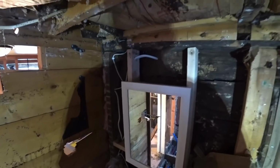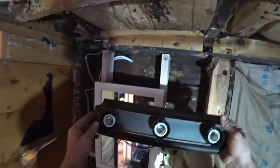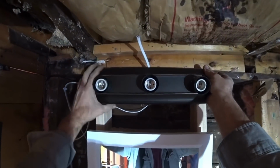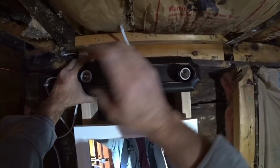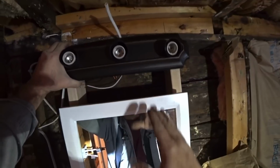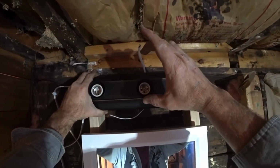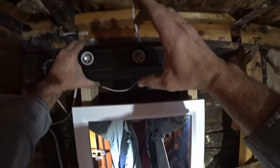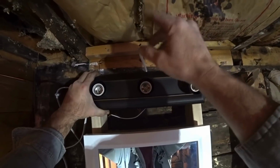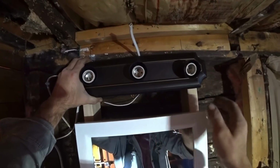He snapped a couple pictures of different bathroom lights, and this was one I think that will work. And see, this can mount up here, and then you just screw in 3 bulbs. And that's why I have this a little bit lower, because the ceiling is up here. You figure the bulbs are about this big, and that way they can be away from the ceiling so they don't heat that up and heat the drywall up and, you know, kind of burn it. And they're still big enough down here that we can open this door.